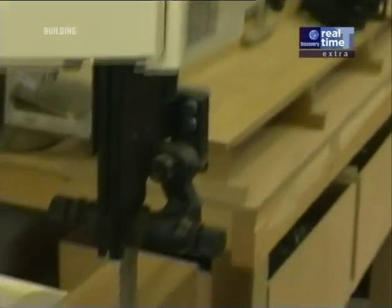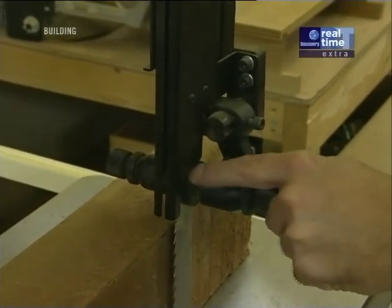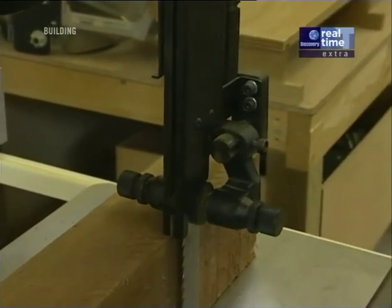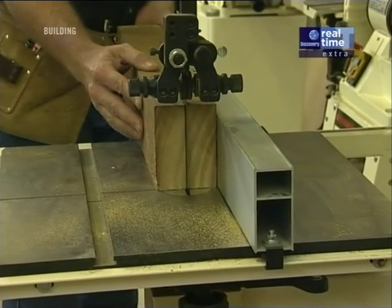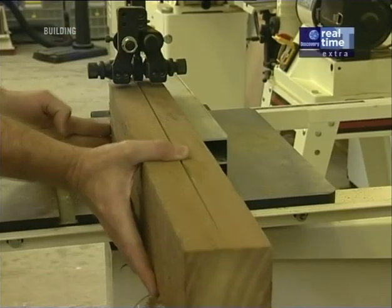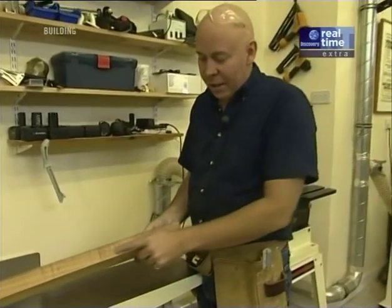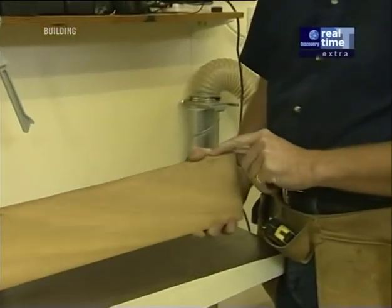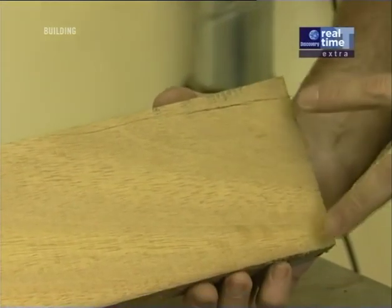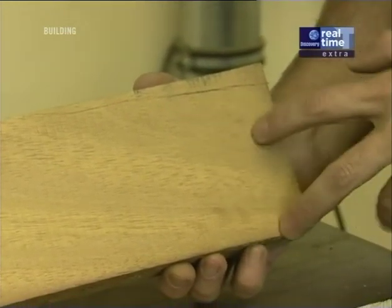One last thing to check before closing up the door is to make sure that the band doesn't come off the wheel as it's rotating, and that looks great. The next thing is to wind the safety guard down — it protects your fingers but it also has a couple of little bearings that stop the blade from wandering, and you want this to be as close down to the work as you can get it. With the fence set to 40mm I'm ready to rough cut the pieces out. Sometimes when you cut a piece of wood in half you get a few unpleasant surprises. There was no indication on the edge of this board of any problem, but when I turned it over I found a split that ran right to the end. I'm not too worried though, because I only want a 75mm wide board out of this piece and I've got plenty of space to get that.